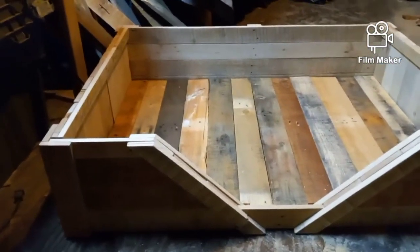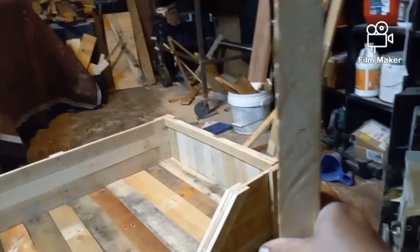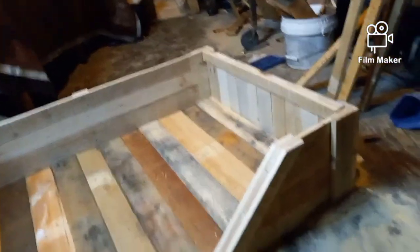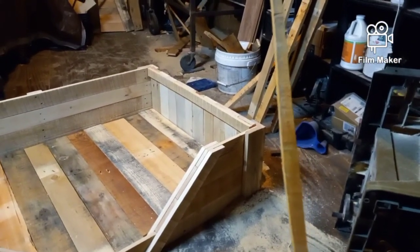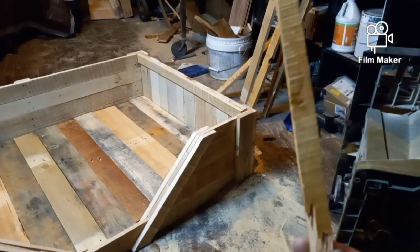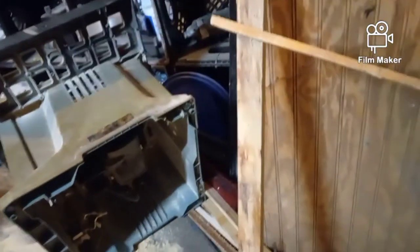Now for the floor, all I did was I took a 2x4, and once again, you know I love to do this. I took a 2x4 and I ripped it down to 1.5 inches. Now that's a little less than halfway. You can't just rip it in complete half because it's 3.5 inches wide. So your pieces would be 1 and 3/4 inches by 1.5 inches, and then you mess them up because you put one this way and the other one that way. So I just run the second one through and also take off that extra, so that they're all identical, 1.5 by 1.5.